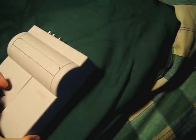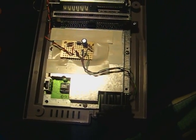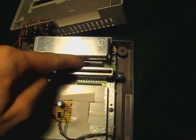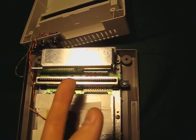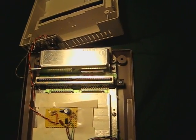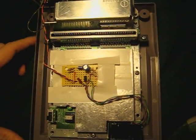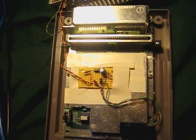I'll show you what happens on the inside. Looks like I need to tie this down a little bit better. I could have easily just pulled the video off right before it goes back into the RF box, because that's just a composite video line going into the RF box along with the audio line, combining them and putting them through the port for your RF switch. But like I said, if I use the actual video circuit that goes through there, it would not actually improve the video quality that much — it would just get rid of what RF does to the signal, the greeniness and the bad signal.